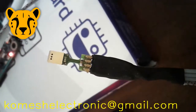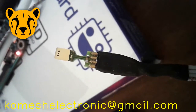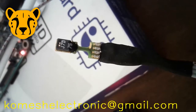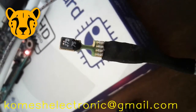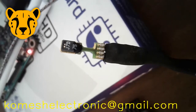The SHT75 is a high-end version digital relative humidity and temperature sensor IC in a 4-pin SIP package. This sensor integrates sensor elements and signal processing in a compact format. It provides fully calibrated digital output. The Tinkerboard reads data from the sensor, displays it, and sends the data as Modbus to the PLC.